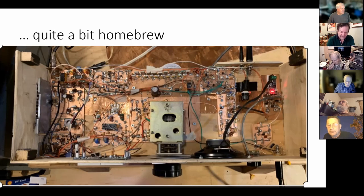Yeah. So you also can do it with a spectrum analyzer and a tracking generator, which is what I did. I have a little test fixture. I put my crystal in and then substitute a little 100 ohm variable resistor to get the series resistance. And it's not that hard. I bought like 100 crystals for $10 off eBay. And I went through and measured them all and sorted them out. So I got all the approximately correct series resonant frequencies, all about the same. And then I was able to use the Dishal software and I built some filters.